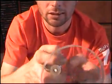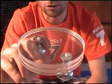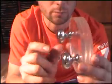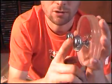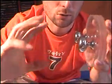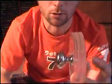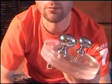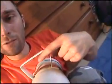It also makes it a lot easier to get your hands in the pipe and pull it out. You can use a different handle, or if you want you can just use another bit of perspex and glue it to make it flush when you screw the end cap on. Just make sure it's not too long, otherwise when you screw the end cap on the seal, the end cap won't seal and you'll be relying on just those two seals. With three seals you'll have no problem with water getting in and destroying your camera.